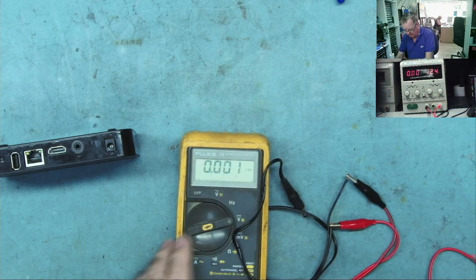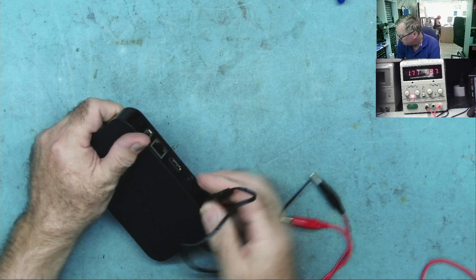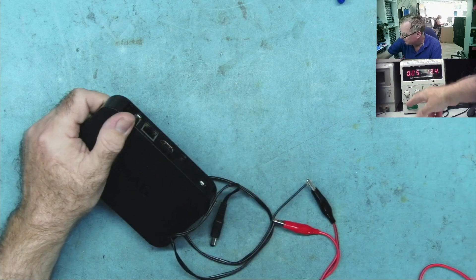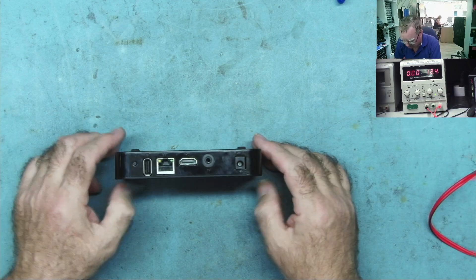And it's working. Quick look at the power supply — we'll just plug this in and see what it does. And there's a short somewhere. Straight away the constant current light comes on: 5 amps. This has a short. You see how useful that is? Bench power supply, guys.